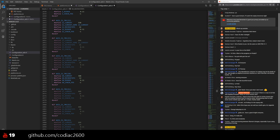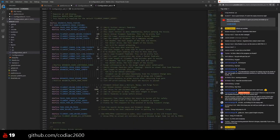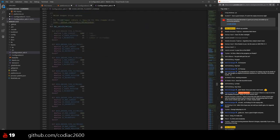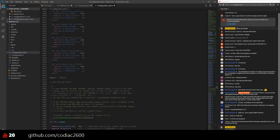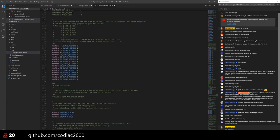You know, maybe you won't do a homing between. You know what? We won't. We'll disable. That's actually a good call. Tristan actually said home before filament change. Let's go ahead and remove that. We are using sensorless homing. Sometimes that can be tricky. So that's a great, great idea. So let's go ahead and we're going to disable the home before filament change. So if you followed along, I apologize, but that's actually a better move than what I had.